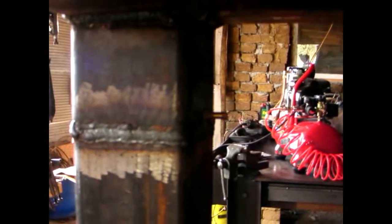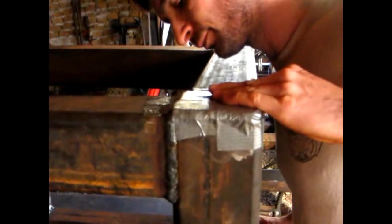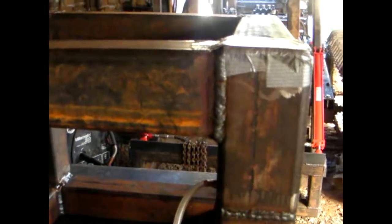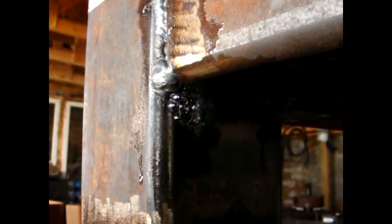We're going to pump air in through the fuel outlet to see if we have any leaks. The air compressor is hooked up to the fuel outlet — that's the one outlet. That's the fuel. Hold on, that's only testing leaks in the fuel. Yeah, okay — we have a little leak.